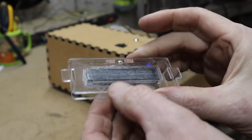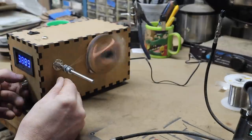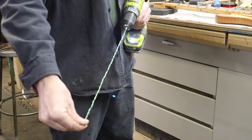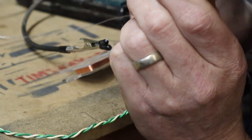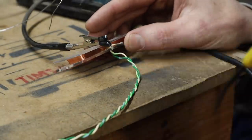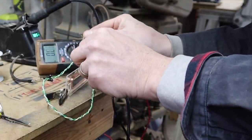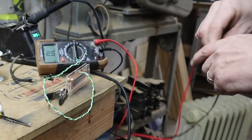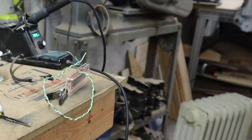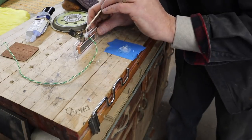There are obviously a lot of gold foil elements missing, but I'm mimicking them with the pickup wire and magnet in the middle. I need to wire my leads, so I thought I'd put a little copper tape on the plastic and solder to it. I did some experiments and it worked, but it sort of melted into the plastic and I didn't give myself enough room to do it nicely. My neat little copper patches didn't hold, but I've got resistance now at 5.44k. It's floating and I'm afraid to mess with it too much, so I'm going to secure it all with epoxy.